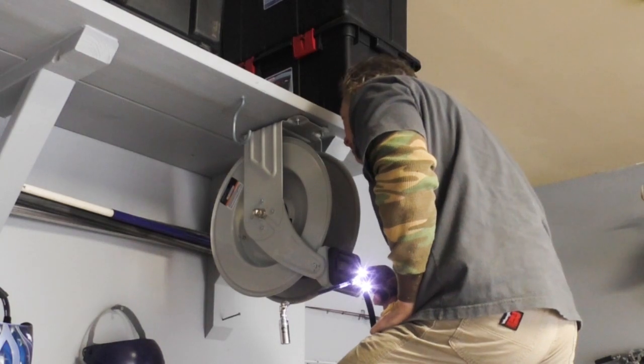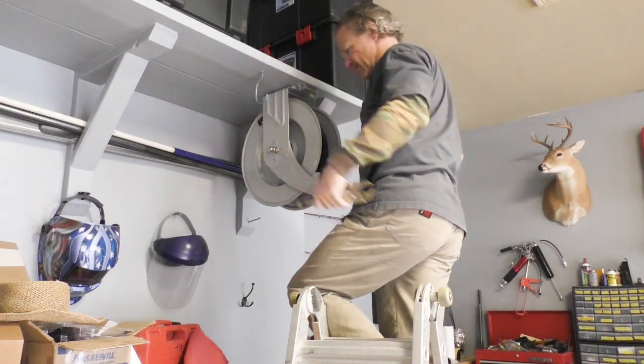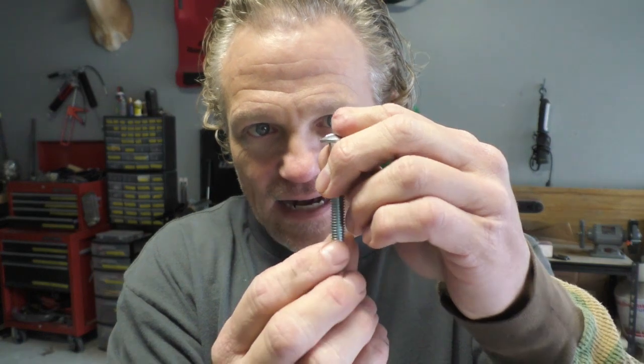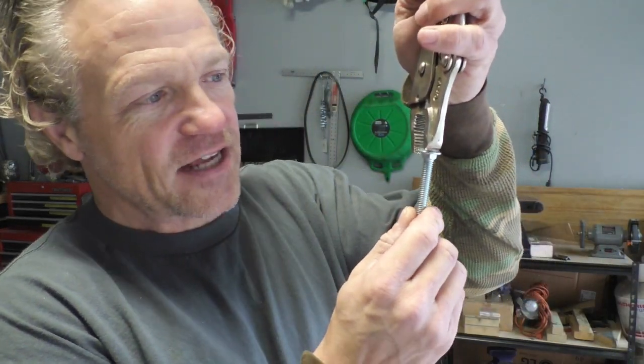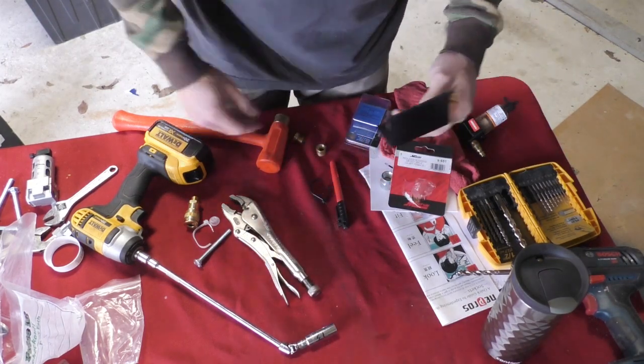They're already stripping out in the wood. What I had was my 2x12 shelf with a hole drilled through it, and exactly what I expected happened — as I began to tighten the nylock nut, the square piece at the bottom started stripping in the wood and just made a circle. The solution I came up with was to take my vise grip and grab the top of the bolt just enough to get that nylock nut to cinch up, and it's perfectly tight. So we're ready to move on.